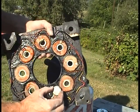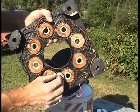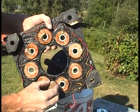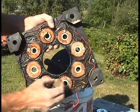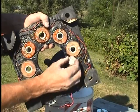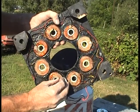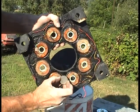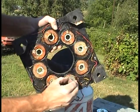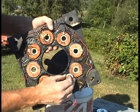That's the firing position — and it moves over here and goes around. When you have north-south, so if this is facing north this way, when you have south over here, you also get the same direction of push-pull going on. That's why it's good to have a north-south rotor — you can do this coil overlap thing and get a lot more power. Also, if you were just to have a single coil against a magnet, it'll tend to push it outward or pull it to the coil. But when you do it like this, it makes the magnet want to go in a lateral direction with a lot of force. So this is a really good way to make a powerful motor.